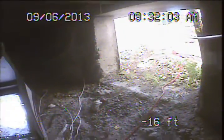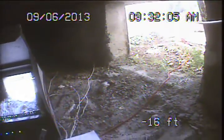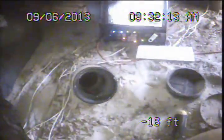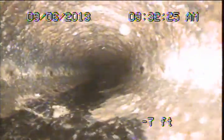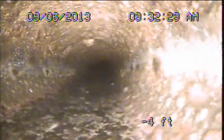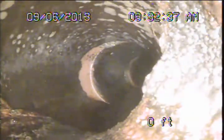It's off to the right of the front entry and off to the right of the driveway. I've had to bring my gear in here. I'm going to drop in here and push through about fifteen or so feet of piping to get outside into the clay main sewer pipe. This is very difficult access, and we are also on a smaller three-inch pipe that we have to go through to get to this four-inch vitrified clay main sewer pipe.